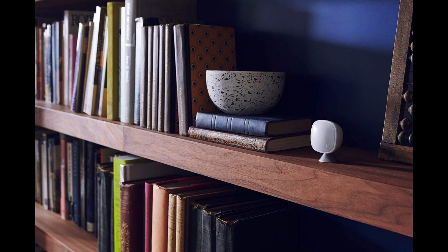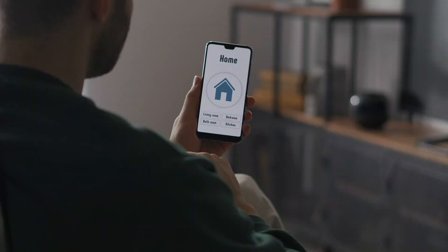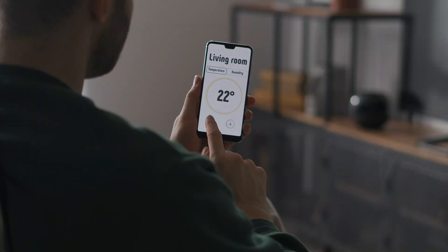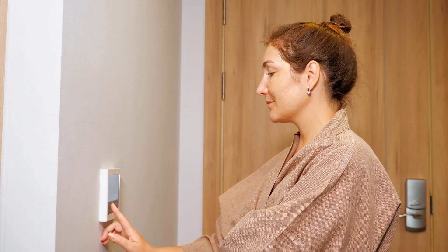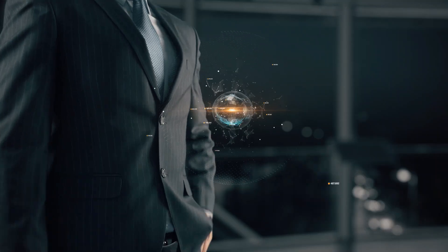This allows us to put the sensor in the location where our thermostat originally is, freeing us up to move the thermostat wherever we'd like — to a very convenient location where it's extremely easy to run one extra wire to hook up a common. In some cases you can even locate the thermostat right on the unit itself, so we're only talking about two or three feet of wire. With today's thermostats you can control them from smart home panels, apps on your phone, even through Alexa, so physically standing in front of your thermostat is pretty rare nowadays.